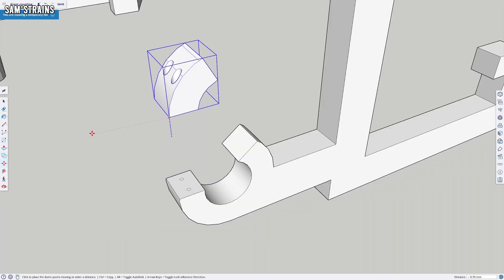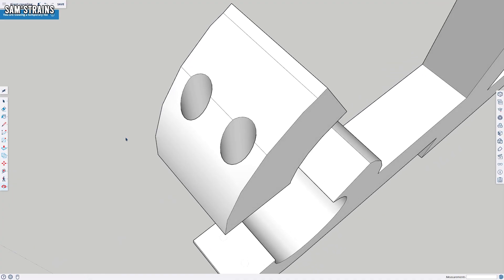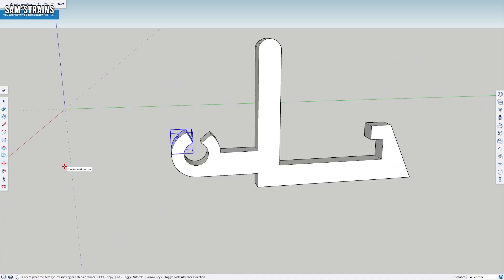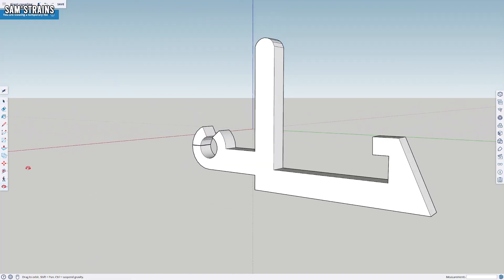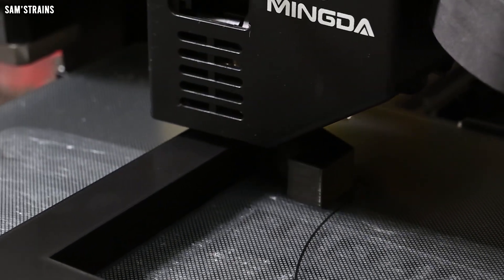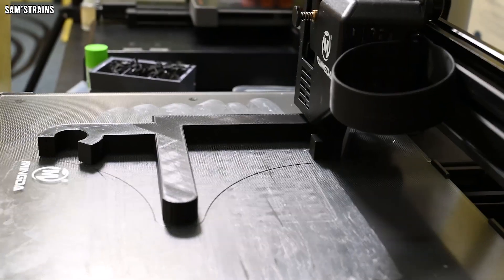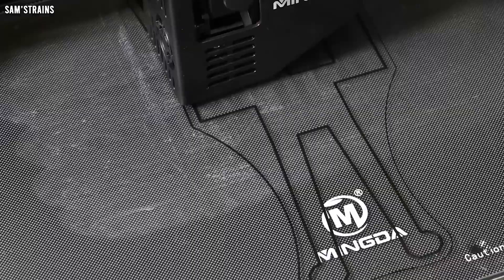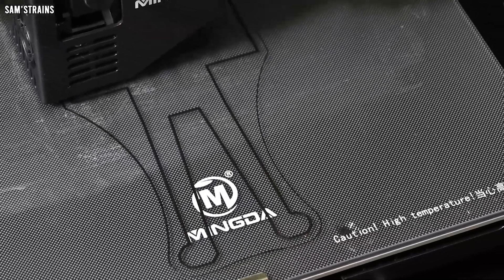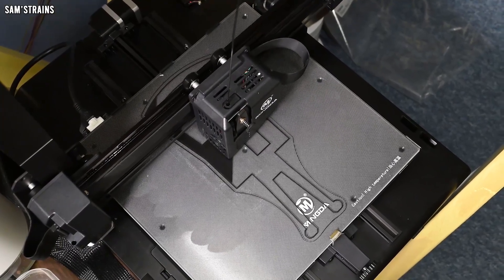So what I've done is split the hook section into two separate parts and added some screw holes and screw threads so that I can put everything in place and then screw the hook together, meaning I don't actually have to stress any parts in order to put these together. That's got to be the way to do this. Now it is time to try the print. I'm starting off with the coupling hook itself - just the main section - and the estimate for this print job is six hours. The NEM coupling itself is going to take over 12 hours even with settings adjusted to make it print faster.